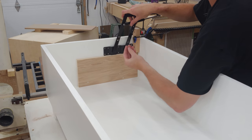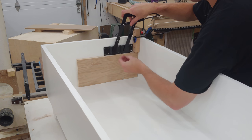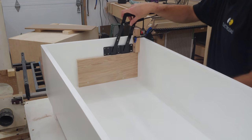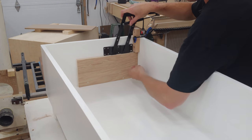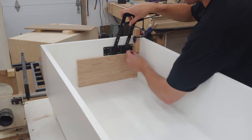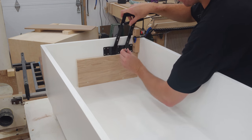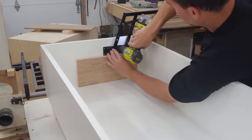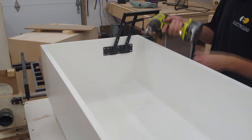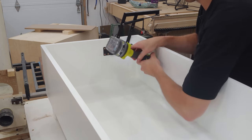So there's a little half inch countersink Phillips head screws that came with these brackets, which is nice. But these ones over here at the front, they're way bigger slots. So I had to go ahead and use my own, I think these are 5/8 inch, huge number 3 Robertson button head screws. And these will cover that area, so I don't need to use a washer. Nice big head on these. Go ahead and remove these spacers. Switch over to my number 3 Robertson.